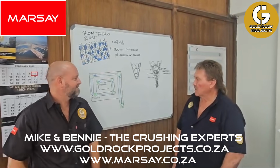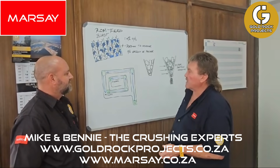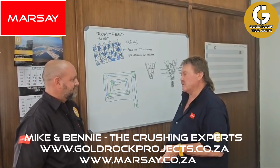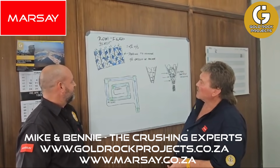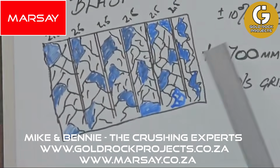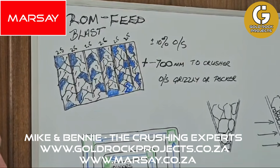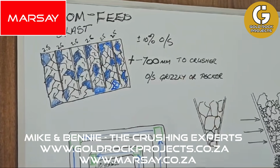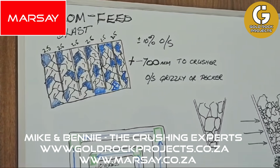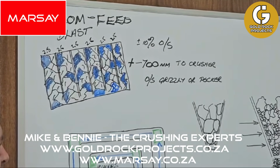Benny, over to you. Like you said, obviously your feed to the plant, the ROM or run of mine, it's cheaper to drill than to blast, than to crush. So that's very important. We normally have a 2.5 burden to spacing. You get a good fragmentation, maybe 10% oversize, and you end up with 700mm material to your crusher. The oversize will be scalped off by a grizzly, or you'll have a hydraulic picker in the quarry that will break that. Your operator will move it to the side. So that's the blasted material, and like I said, that relates to your plant and goes to your crusher.